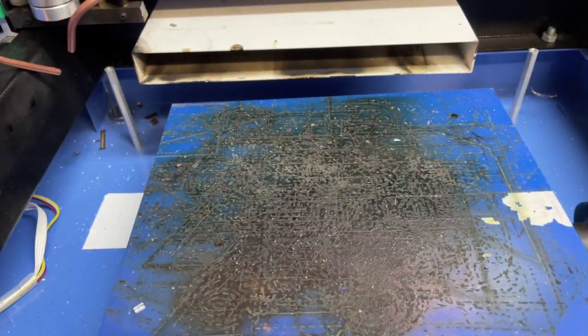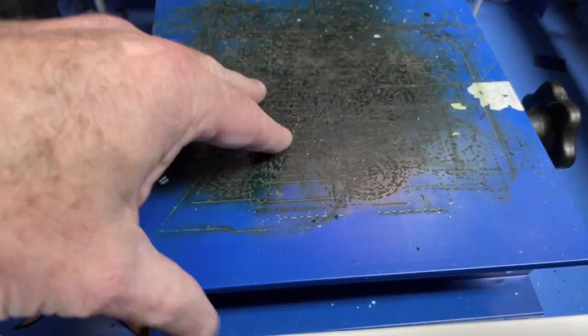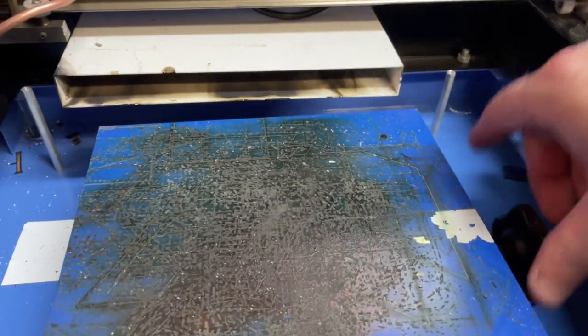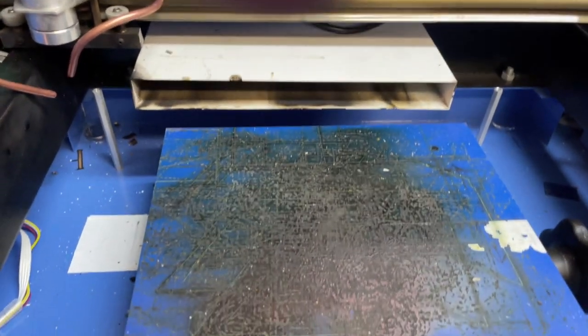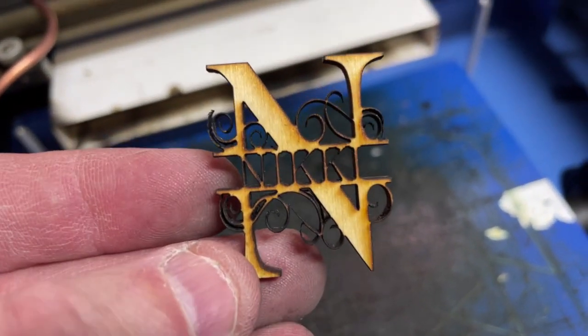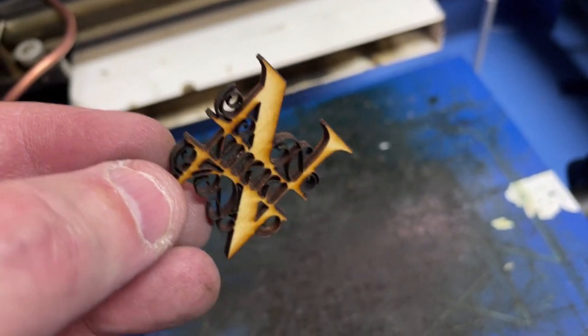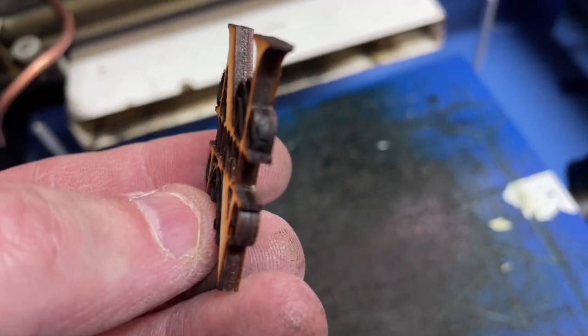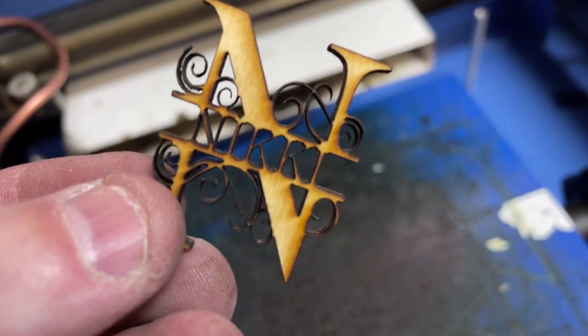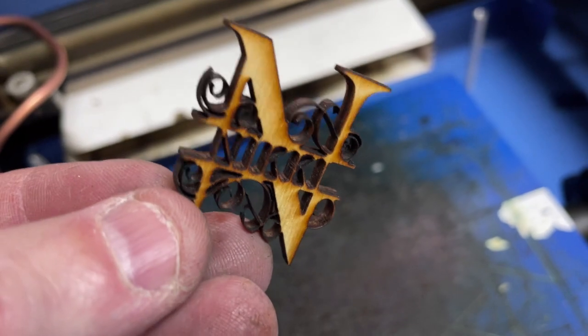You might be able to find different ones. For everything I've been doing lately, this has been working. You can see how the laser kind of burned through and charred the top of this, but that's okay — it's no big deal. Here's the knob over here to adjust these. I have it adjusted just where I need it for that type of wood and acrylic; they're both pretty much the same. So once I got it adjusted, it's pretty much ready to go. I get fine cuts and I'll show you something I did just a little bit ago — it's only an inch big and it's made out of some kind of basswood. It's not that thick and look at the fine cuts I got on that — some really fine scroll cuts. Very fine. I was really impressed with that.